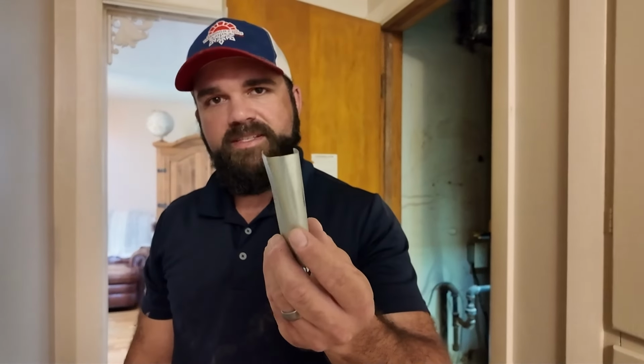My guess was that at some point there was a rattle from the furnace, and a previous technician thought that the heat exchanger tubes were maybe rattling. And so they used these to try to wedge in between them just to keep them still. Very risky fix if you're just leaving free floating pieces of metal up in the heat exchanger. So we'll dive in deeper.